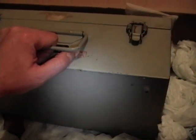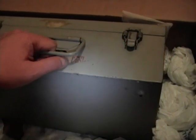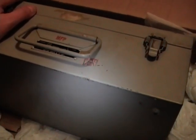I had one of these back when I was around 15 or so and I spent a while trying to get mine to work. The problem is the one I had was decommissioned, which meant they had opened it up and cut just about every single wire — dozens if not hundreds of wires — but left them all in there, just snipped. That was pretty common with equipment in the 40s, 50s, and 60s. I got the schematic, spliced the wires back together, and bought a new old stock power transformer from Fair Radio Sales.